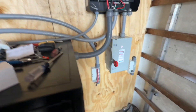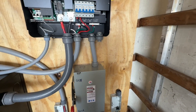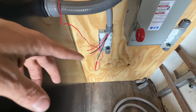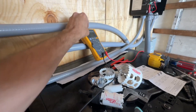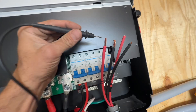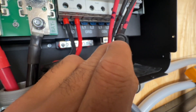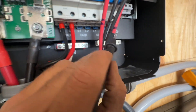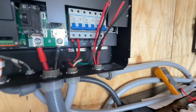Then I measured the conduit to length and installed it, and I'll be doing the same for this inverter now. To figure out which is string one and string two for PV input one and two, get your multimeter out, put it on continuity — the setting that beeps — take one end, shove it in one terminal, take the other end and touch them together until you get a beep. I marked it with a marker: one dash for PV1. I've figured out both sides this way. I then took a piece of electrical tape and separated PV1 from PV2.